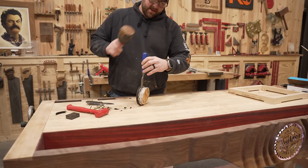So I need to somehow get these to line up perfectly so I have a perfect reveal on the outside. When I was trying to think about this before, I thought it would be easier if I beveled the one side. And so because I beveled it, I can't find center from the bottom. Oh, are you admiring my miniature router table that we're using again? Yeah, this thing rolls. Grab a plan, build yourself one, join me in being awesome. So what I'm gonna do is get close to this so we're not removing a ton of material. This is as close as we're gonna get, trying to leave a little bit of a golden ring on this sucker.